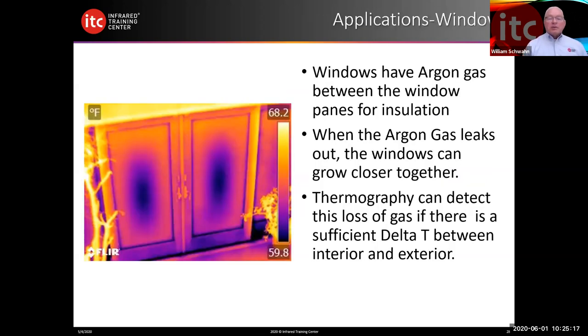We have to talk a little bit about windows. As home inspectors, we know windows have argon gas between the panes for insulation. When that gas leaks out, the windows can actually grow closer together. This image shows what happens when argon gas has left the seal — energy from the outside and inside shows in an oval inside the window. This is a good indicator that the window may have lost its thermal seal long before you see any condensation. Many windows are warranted, so I did a fair amount of this work for people in new homes, helping them get repairs covered under warranty before it expired. These types of windows could easily be over $750.